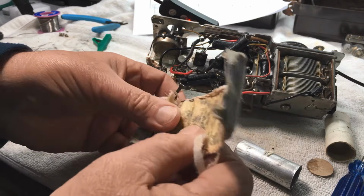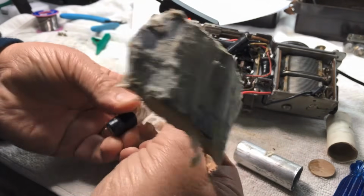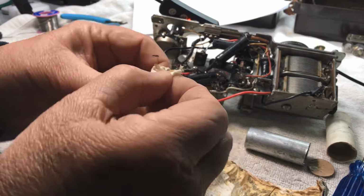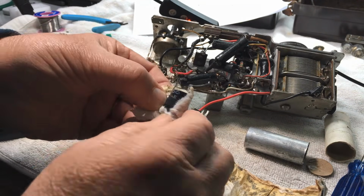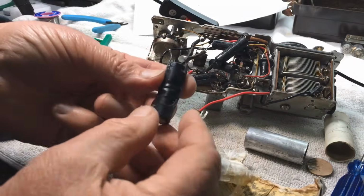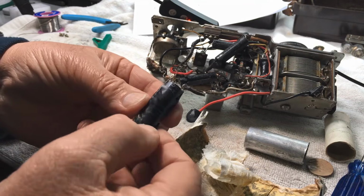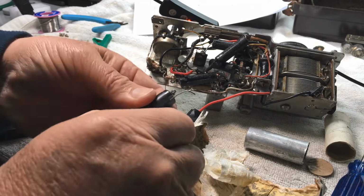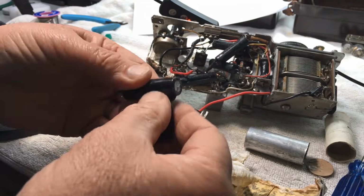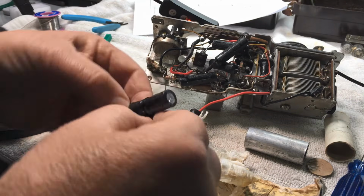That's pretty amazing that someone has actually gone to that trouble, and that is really restuffing the cap, isn't it? It's putting the old cap back in there. And there he is: 2, well, hopefully fairly good electros. Now the capacitor was a 20 microfarad. The value on that cap is they're both 10 mics in parallel. So we're looking at 20 mic there, and I'm pretty sure they're 400 volt caps.